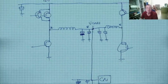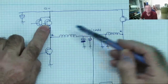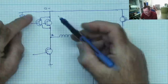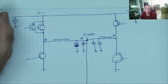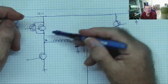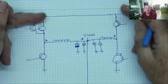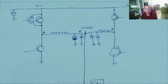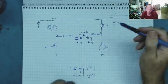The way the micro-ohm method should work: the coil has some resistance, maybe 5 milliohms. If the short is on one side, measuring from that side's junction to ground will give a slightly lower reading than measuring from the other side — by the resistance of the coil. It didn't work here because the readings were all the same, suggesting multiple shorts. The ESR meter at 100kHz should add the coil's AC impedance to help distinguish sides, but again all readings were the same. So I removed the inductors and now found the short still exists on both sides.